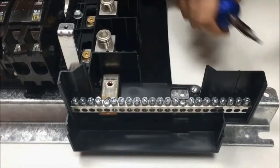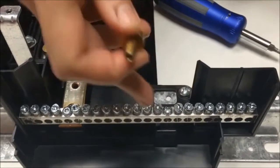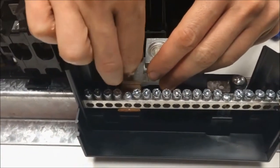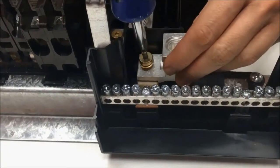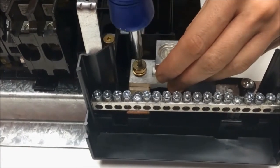If you are not using this device as service entrance equipment you will not have a neutral bonding strap. You would install the lug in the same spot however — just find the neutral bar on the right hand side of the panel board and install the lug into the hole right next to it. Torque the lug to 25 to 30 pound-inches.